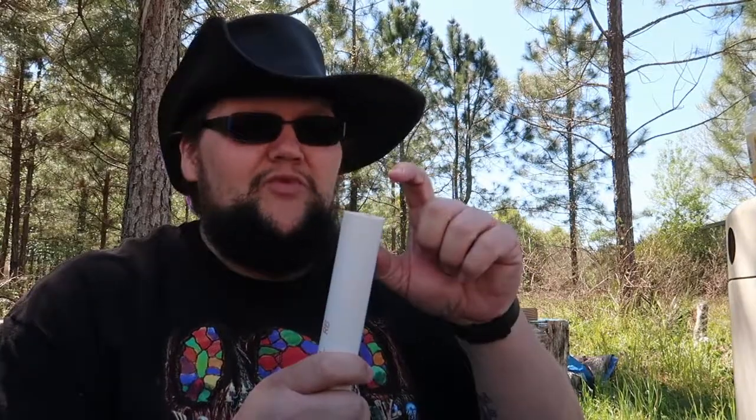When you're going for PVC, you want to make sure you put proper cement glue. Look at the glue based on what you're going to be doing. The glue I got works okay in wet conditions, so in the event that this pipe on the outside was a little bit moist, it would still seal properly. My pump doesn't have a lot of pressure, so I don't need an industrial glue — I just need a standard PVC cement to hold this together. I went ahead and picked up a new jar. This is Red Hot Blue PVC pipe cement, medium body, very fast dry and set, which is what I'm looking for — because luckily the pump broke on the way out this morning, so nobody's needed it.